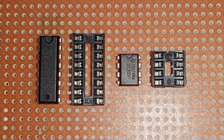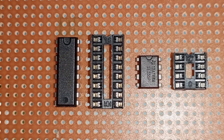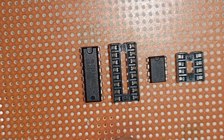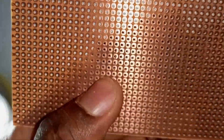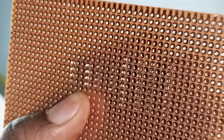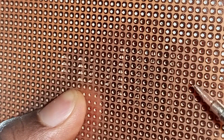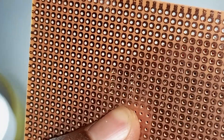In most cases, when you'll be working on a circuit board, you'll be working on the rear side. So you need to note something very important: when you tilt the board to work at the back, the direction of the pins changes. Before we were counting anti-clockwise from the front, but at the rear side of the board you'll be counting the IC pins clockwise.